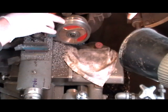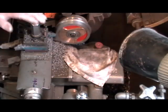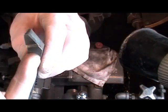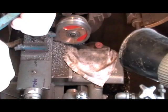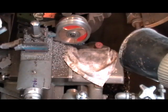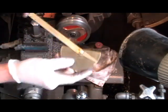That way I'll get all my wheels exactly the same. I've got a tool set in my tool post — very similar to that shape, except it's not cranked, it's just straight — but it's got a sixteenth radius. I measured that with my radius gauges and it's a sixteenth radius in the corner with the cutting edges. I've got that set in my tool post and I've got that set at 20 degrees to the face of my work.